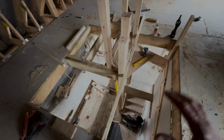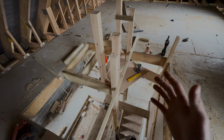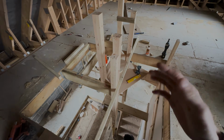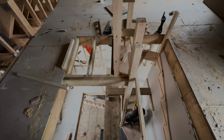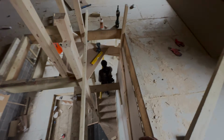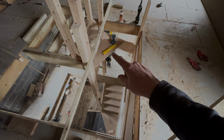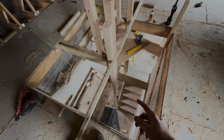We're continuously checking the newels as we go because it's a lot easier to level them up now, and we're putting the risers and stuff in to hold them level, prop them level. Everything should be level, because you want to make it as good as possible for the second fixers behind you. So now we're going to infill the risers as we go, and then tread as we come behind, get the glue blocks on as we come down.